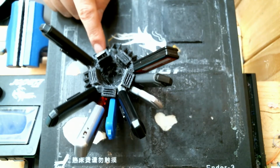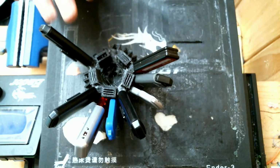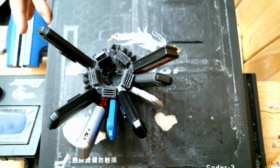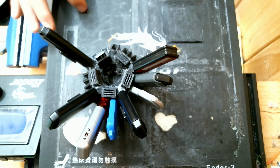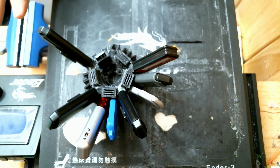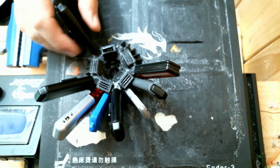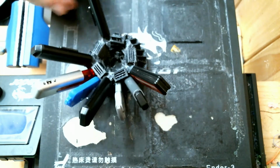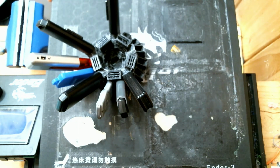on how well the print came out, because like I say, if you've ever dealt with a lot of printing, you'll realize that if you have this nice little print surface, your board, whatever you want to call it, even slightly unbalanced or slightly unlevel, you will get some variations. That's why a lot of us will put extra layers on the front. There are a lot of things you can do to mitigate it, but the best thing to do is actually make sure this thing's level.